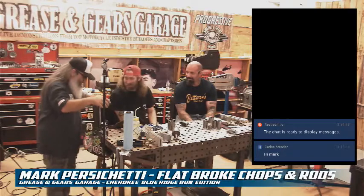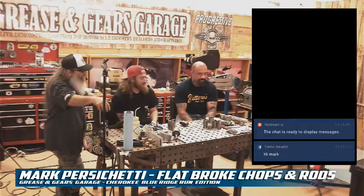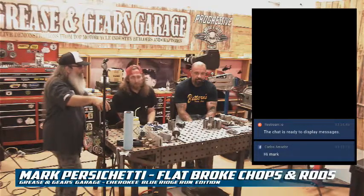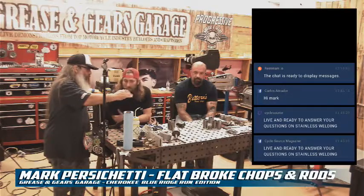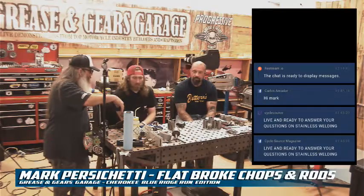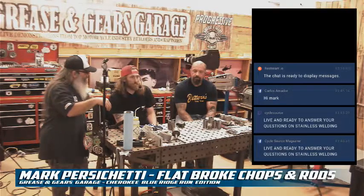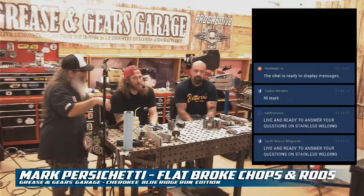We're just gonna go over some stainless processes on cleanliness and tips that we do. Because if you don't do the same thing every time, you can't rule out any variables if you're having problems. If we get to aluminum, I brought some. Well, let's get a game plan and see what we got going on. Normally if you do stainless steel exhaust, you're going to want to purge it, inner purge it, because it'll sugar on the inside because oxygen will be introduced into the molten metal.